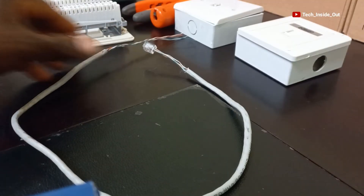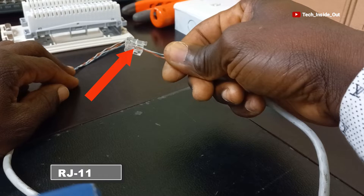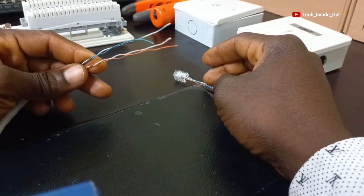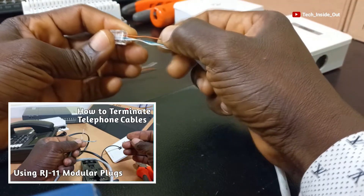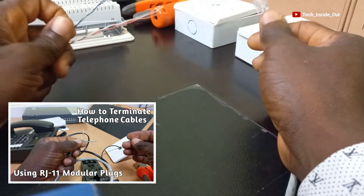Here is a CAT5 cable which is part of the cables we'll be using for the wiring of the DP. This end has an RJ11 connector placed on it. The end with the RJ11 plug is what will be connecting into an extension jack on the PABX switch, and the other end will be terminated onto the distribution point. If you want to learn how the RJ11 termination is done, you can visit an earlier video on how to terminate a telephone RJ11 plug — the link is in the description.